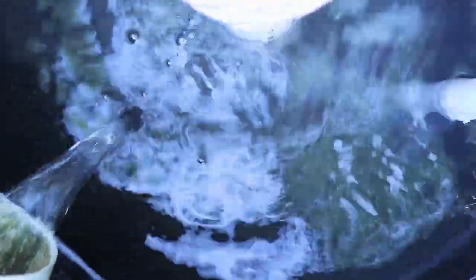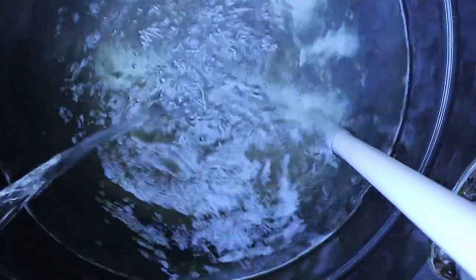There's no pressure on it. This over here is a vent tube, so it allows any suction to go through. I just got it open — it was stuck. Now it's draining down into the penstock, which was empty. The penstock has a capacity of about 70 gallons. Now we can hear that it's actually pulling a suction. I can put my thumb over this and it'll suck down even harder.